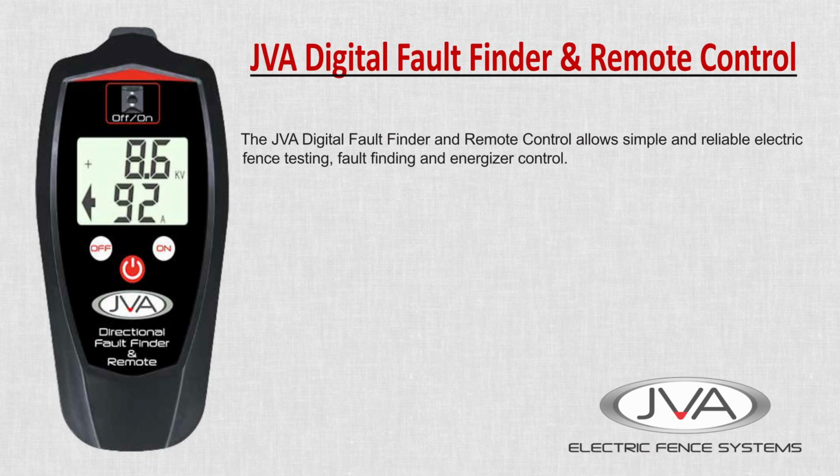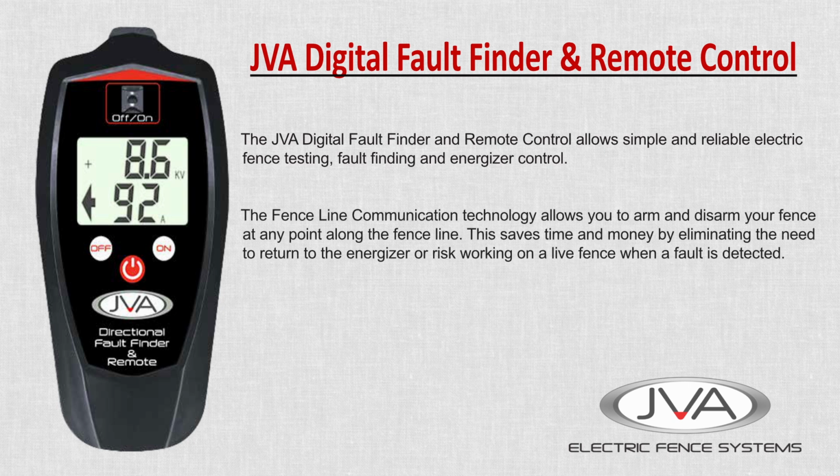The JVA Digital Fault Finder and Remote Control allows simple and reliable electric fence testing, fault finding, and Energizer control. The fence line communication technology allows you to arm and disarm your fence at any point along the fence line. This saves you time and money, as when you find a fault, there is no need to risk a shock trying to work on a live fence or having the cost of traveling back to the Energizer to switch it off to work on the fence.